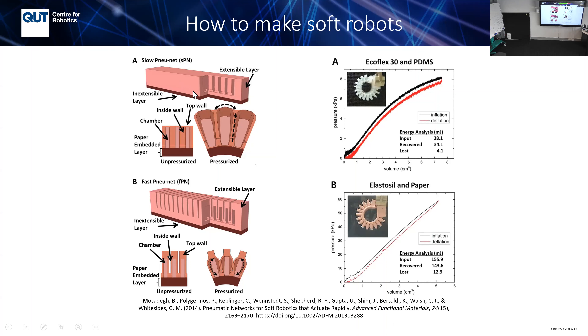After baking, the material holds its shape and you remove the inner mold. Then you attach it to a reinforcing material — paper, PDMS, cloth, or thread. Reinforcement is important because if it's purely a very soft material, you can't output force in a specific direction. The harder material reinforcement directs the force output the way you want.